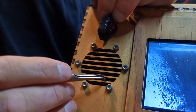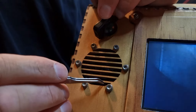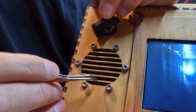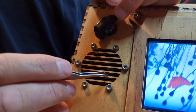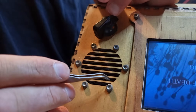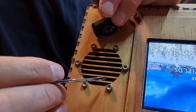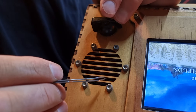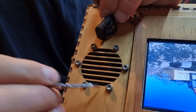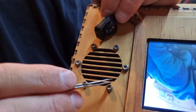There it is — that little point right there. That's a pain because it's glued in to all oblivion — that could be hard to get out. Somebody has overdriven the speaker and left it at maximum volume. But for the time period it's done really well. I could just poke it and leave it for a little bit, but I'm going to have to find a new speaker of that size. It might be easier to rebuild it from scratch.